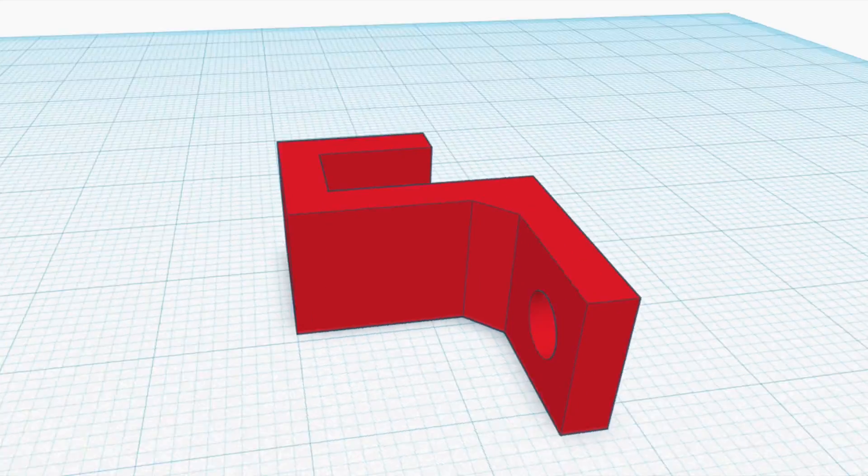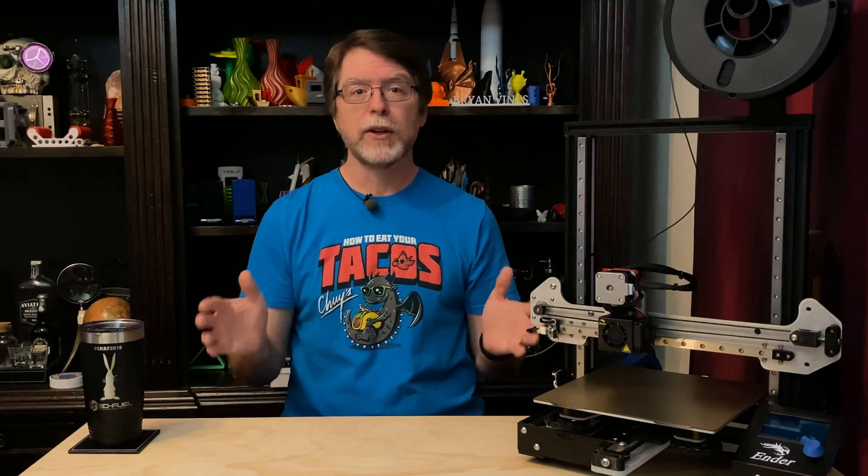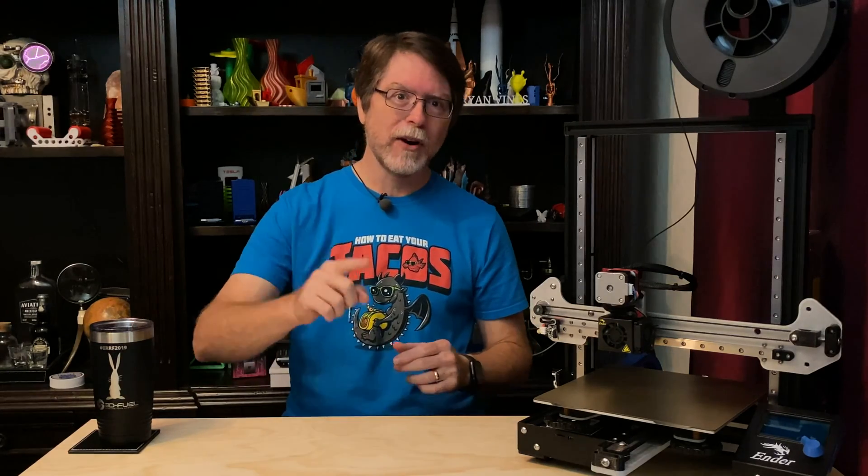There's also a little cutting jig that I designed that you'll need to print out to help you get the PTFE tube cut to the correct length. It's linked in the description and it's a quick print — probably 20 minutes tops. I recommend printing it now because it's a lot harder to print when you've got the extruder taken apart. Alright, let's dive on in and get started.